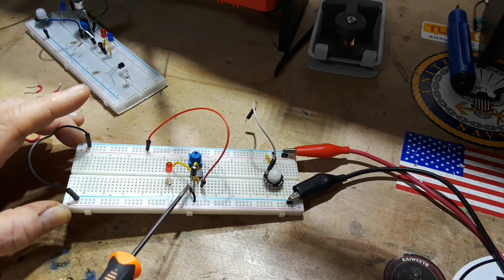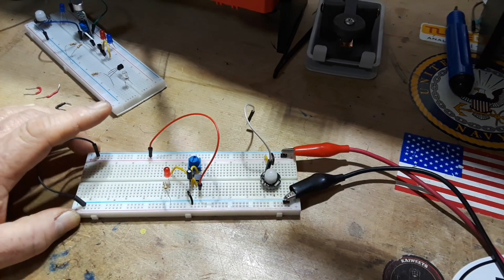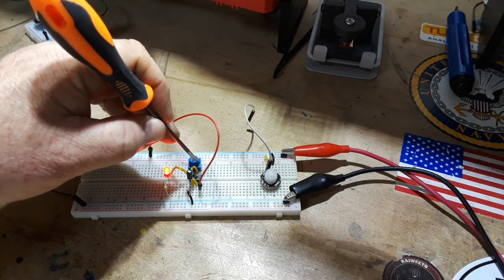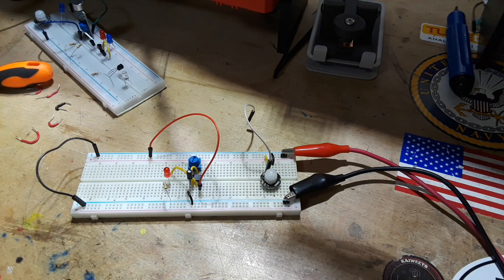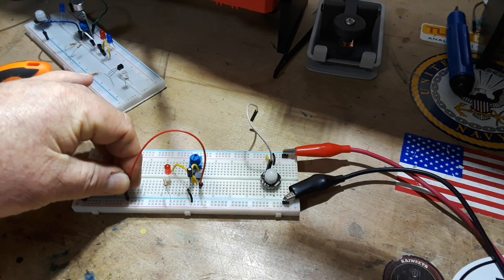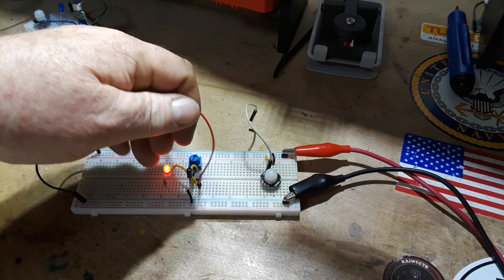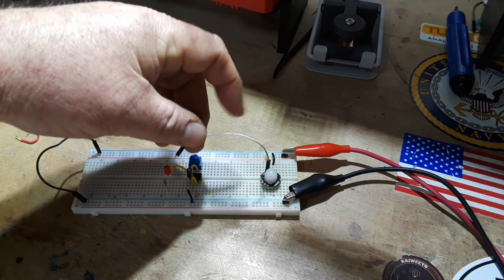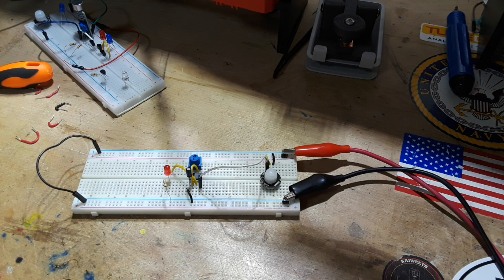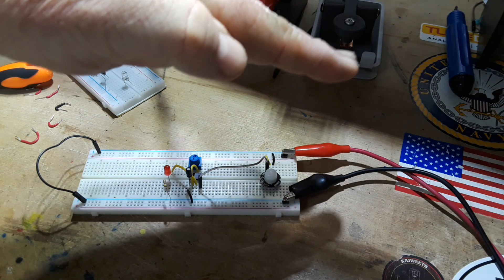Our timing capacitor goes down here between pin 2 and pin 1. Pin 3 is our output. Pin 4 is our reset, and that is what we're going to use as a trigger in this case, because our trigger pin, pin 2, is actually connected up to pin 6 so it keeps blinking. Here's our reset, pin 4 — you can see I have it held high. If I put the reset pin low it holds the 555 timer in reset and it does not let it operate. So I'm going to remove that wire and take the output from our sensor and plug that in there. Give it a couple seconds — now when I move my hand I trigger it and we get a blink.